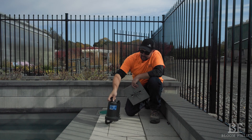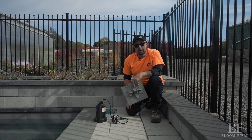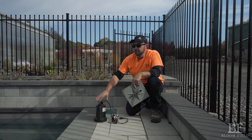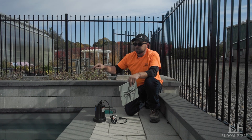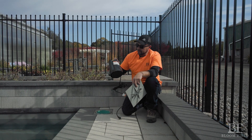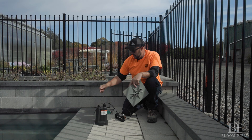What is happening is it's an area where all the groundwater or the hydrostatic pressure caused by groundwater is entering. So we can use a pump like this one I bought at Princess Auto — it has an attachment on the top for a garden hose, so you screw a garden hose to it and you can lower it down into the sump pump. If you have to lower the water in your pool for any reason, we need to reduce that hydrostatic pressure that is on the bottom of the pool. So if there is water when you look in this green pipe, you need to pump it out before you ever lower the water in the pool. This is the most crucial part of this whole video that I need you to remember — this pool without water in it is a boat if there's water under it, and it can pop out of the ground. So if you just buy a cheap pump from Princess Auto, Home Depot, or Canadian Tire that fits down in this pipe, you can reduce all that stress.